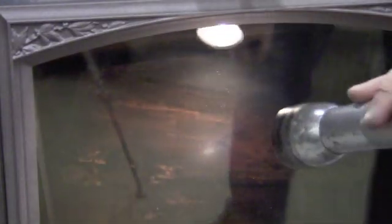I'm relieved because the CO is dropping. What's happening now is there's a little bit of fire every now and then in the bottom of the stove but there's no secondary activity — it's just smoldering. Here we are at two hours and there's still really just a little tiny bit of visible flame in the back and you can see some hot coals in the front.